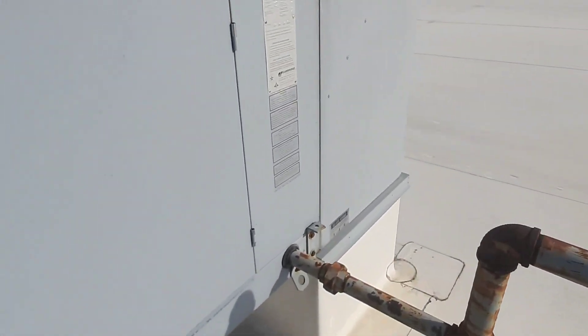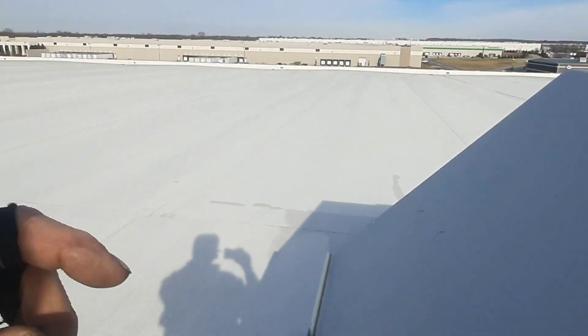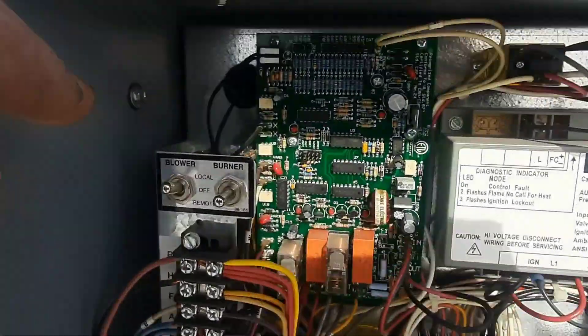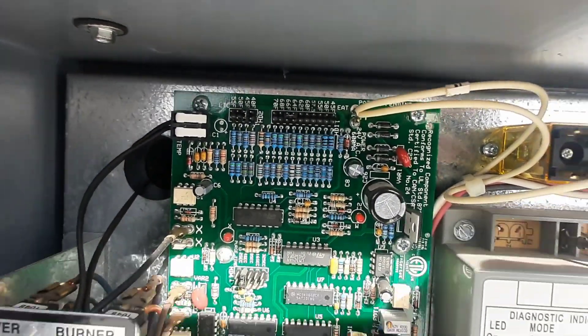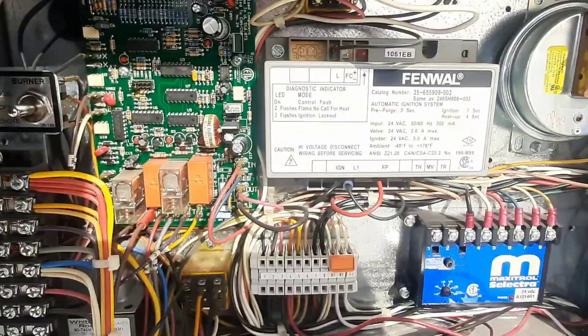Let it run for a minute and see. I think it's three-three and eight, or six and eight maybe. You pull the wire and it goes to low fire; you pull the other wire it goes to high fire, so we can do that as well — make sure the burner modulates that way. This is the entering temp sensor. You can see we're set; that switch is 45. So 45 degrees — if it senses the burner's not fired, it shuts everything off.